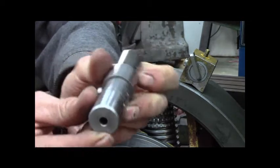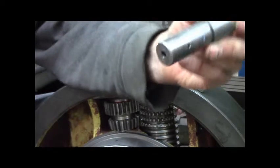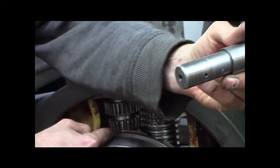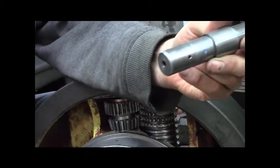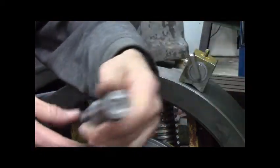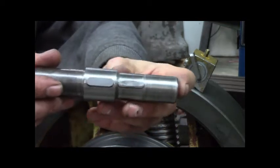Now you see that ball oiler in there - that's a quarter-inch diameter pressing ball oiler. There are holes in there. The oil goes in the top and it's fed into that hole. This hole has a piece of blue plastic in it - I blocked that hole off on purpose because it fed that bevel gear, and I'm not using that bevel gear. It was actually a hole drilled all the way through the bevel gear into the teeth, into the low point of the tooth.